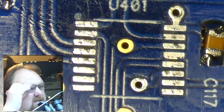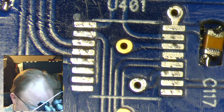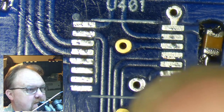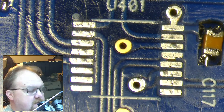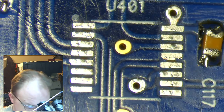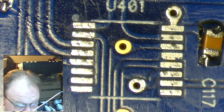All right, so you can see that these pads are pre-tinned. That wasn't on purpose. I was tinning my soldering iron a little bit ago. This was in a previous video, and I happened to let a solder ball fall off and it covered these tins. So I used some solder wick to remove the solder, and then I went ahead and tinned both sides because I figured, regardless of what happens, I'd probably be better off having things symmetrical than having them one side or the other.